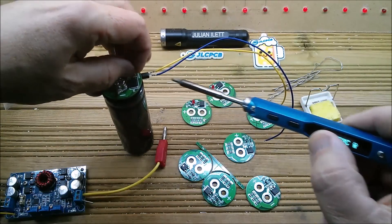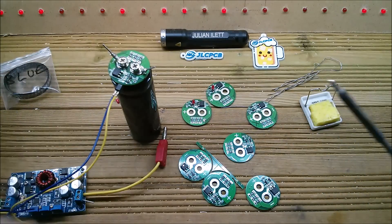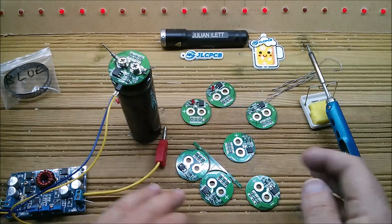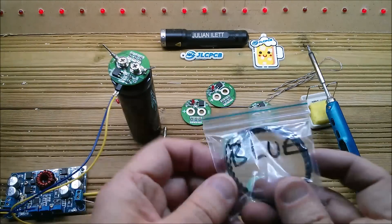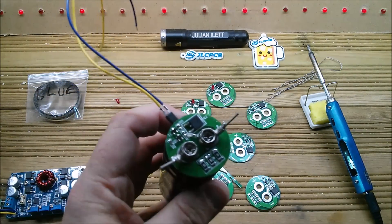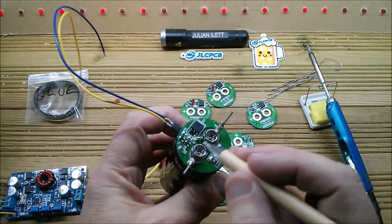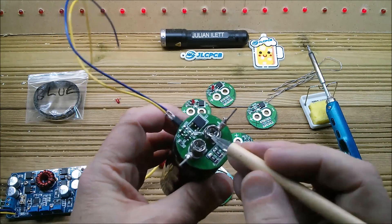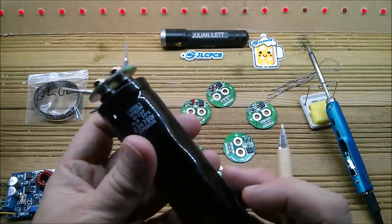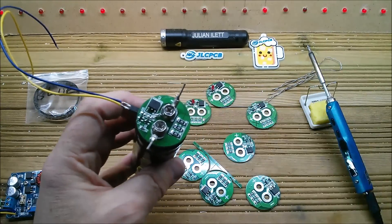It's sort of off. Okay, that's off. So I want all eight boards to not have these red LEDs — they're all coming off. But I want them all to have surface mount blue LEDs. This one now does have its surface mount blue LED. It's strapped directly across pos and neg, so it turns on at about 2.4 volts — that's when the blue LED starts emitting — and at 2.5 volts, which is the maximum for this capacitor, it's bright enough that you can see the thing is fully charged.